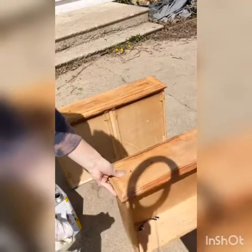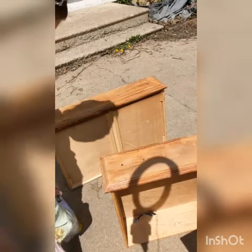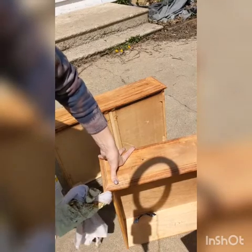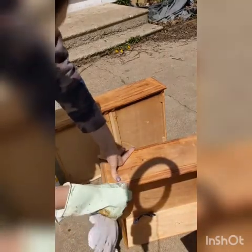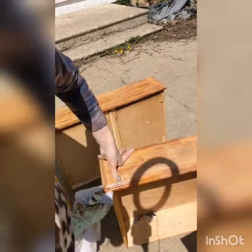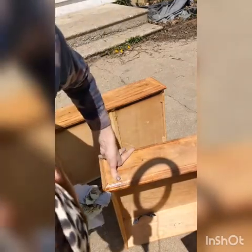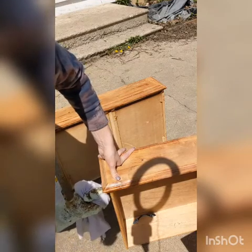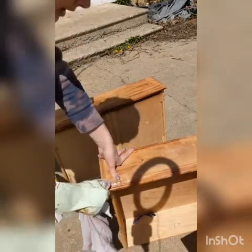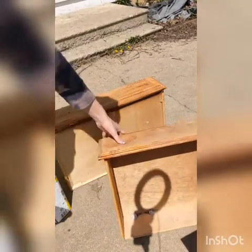You can probably see there's a little bit of stain still left here that didn't come off with the stripper. Since I already wiped with mineral spirits and missed that earlier, I'm going to use the mineral spirits again and work at this leftover stain — it'll start to lift up. It might take a little time but it's better than bringing back the stripper. Between mineral spirits and a little elbow grease from sanding it'll come off. Since I'm going to whitewash, I want as much of the old stain removed as possible, though at the end of the day it'll add a little character.